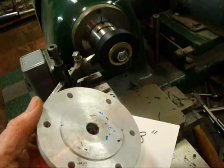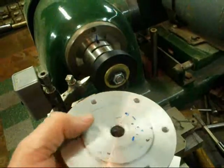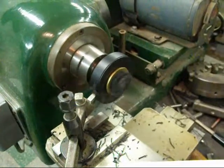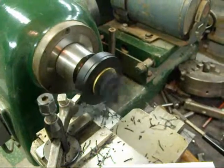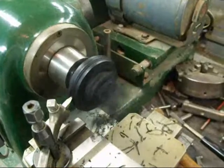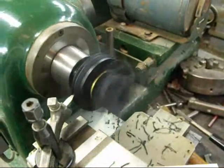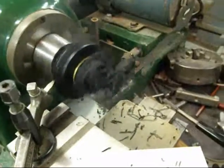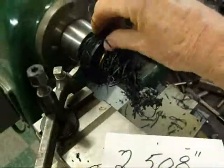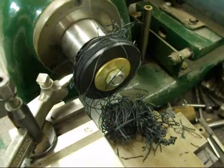I would like a nice free fit through this hole but with no air or steam escaping, and I want a good fit with perfect concentricity. This is probably about 10 minutes of turning and I'm going to take a series of small passes. I don't like the way those plastic chips wrap around there, but at least they won't cut me. I'm using a round-nose tool to pull all that mess off. We're going to find we've got a pretty nice cut — I'll return when this is turned down to diameter.